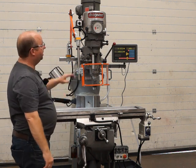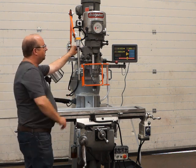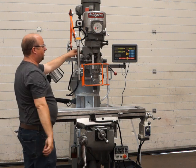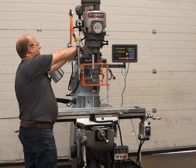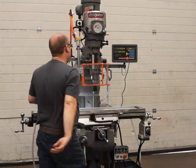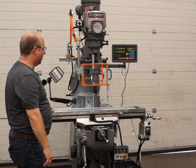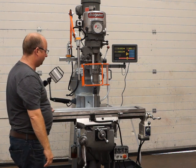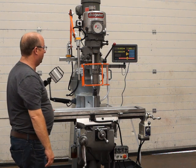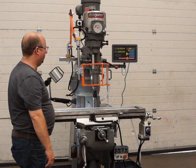Now we're feeding down. So for every spindle speed, you've got 3 different feed rates. So that's at the highest at the moment. It's controlled by this lever here. So moving to the slowest, which is horizontal, and the medium, which is there, which is at the bottom, and they're all working great. Okay, back to the fastest. I'll speed the spindle up a bit, and I'll get it to trip out for you at the bottom, just to show you it will travel the full way and trip out nicely. There we go, trips out great.